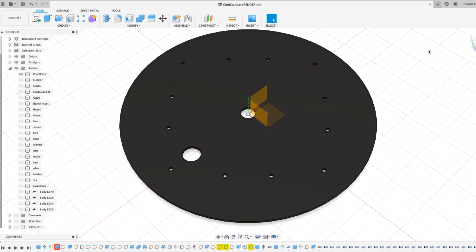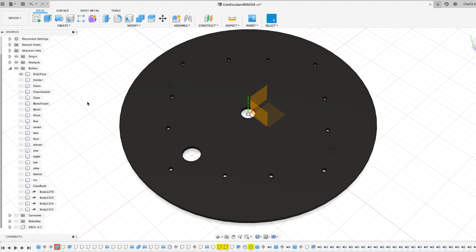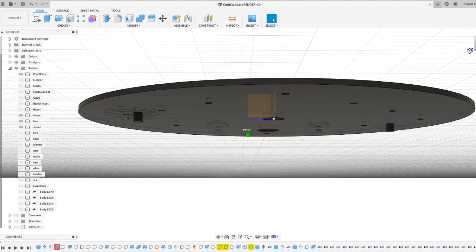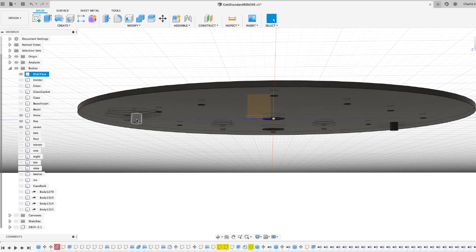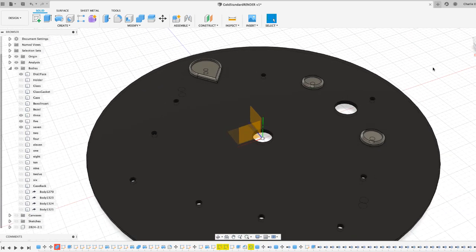It's a fairly complex dial in the sense that we will be using pegged indices rather than just bonded. And just as a matter of interest, the extrusions that you can see here are what secure the dial and stop it from rotating freely once it's inside the case. The indices themselves will be laser cut from steel, and the quarter markers will be flash plated in gold. And we're going to experiment with brushing that gold as well. That may be a detail too far, but we're going to try anyway, because it'd just be another level of complexity which adds to the mystique of the piece, if you like.